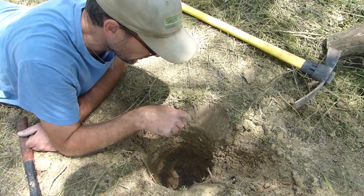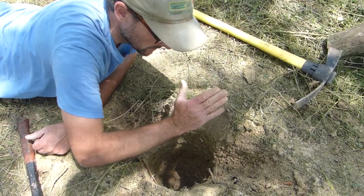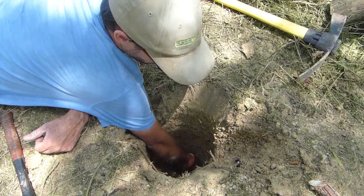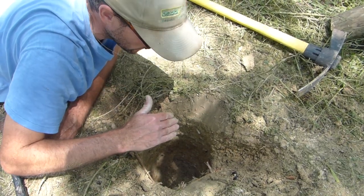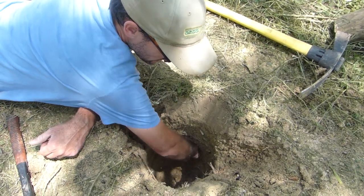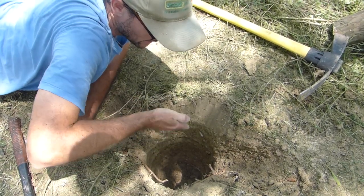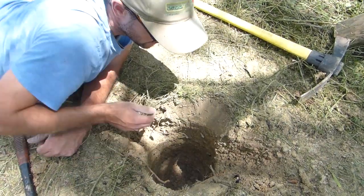I want to point out that the backside — which is the opposite direction of the force — the force of the gate is going that way, which means the bottom of the post is going to be pushing into the bottom of the backside of this hole. When I was digging the hole, I tried to be very aware that the backside needed to be nice and straight and compacted. I didn't want to loosen that soil up and I didn't want the hole to go at any crazy angles. It needed to be straight down so that the post can sit right up against the backside of that hole.